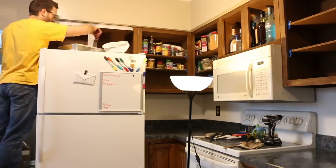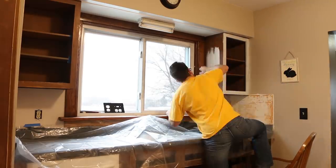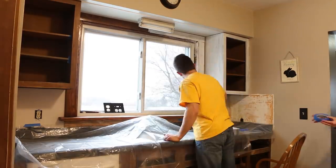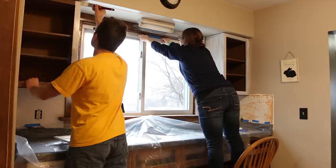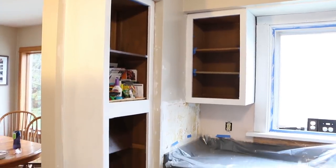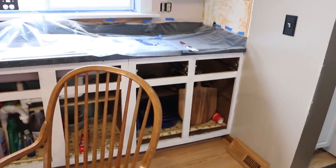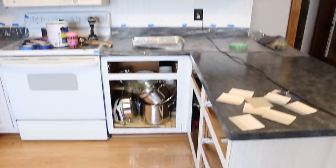Here I'm priming all the cabinets. You can just work along — if you don't worry about the walls, you don't need to tape them off. But there are areas I was concerned with, like the vinyl window, so as I'm painting that area my wife puts on some painter's tape. Blue or green painter's tape is fine — tape all that off while you're putting the primer on. You can see everything is primed now — all the kitchen frames, two coats.